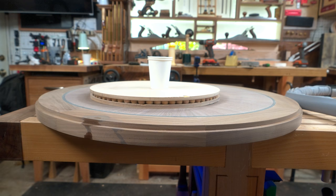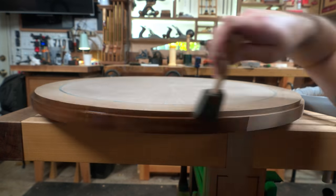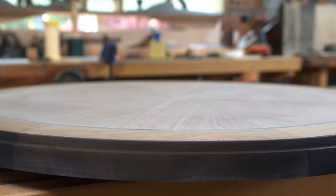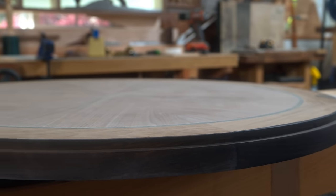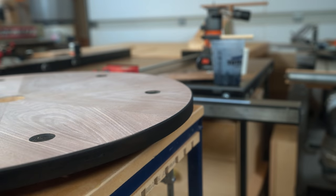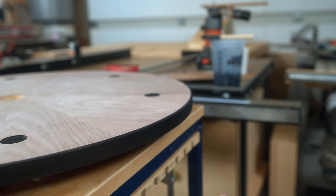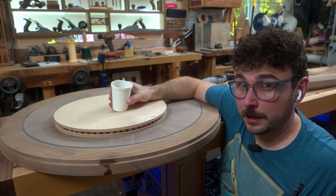This little concoction is two ingredients, vinegar and steel wool. And I still get a kick out of it that it just like blows people's minds what it does to wood. If you're a subscriber, you've seen me use this, but if not, super simple. Steel wool and vinegar creates iron acetate, which reacts with the tannins in the wood. That's it. And a little bit of alchemy. You should see what I can do with water and wine.